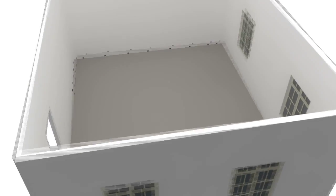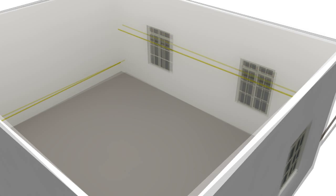Remove the packers and push yellow FON ES5/120 acoustic strips into the gap. Fix the skirting board, ensuring it is fully isolated from the floor treatment.